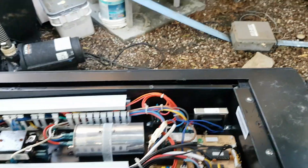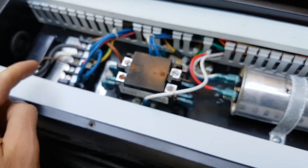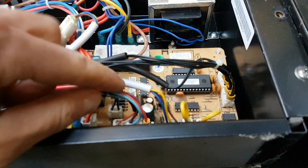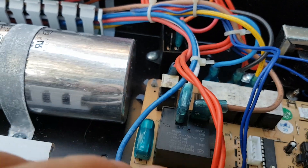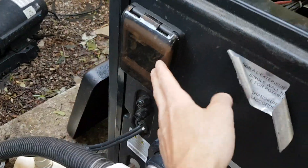We'll remove those screws and lift this cover. Now we have access to the electronics beneath and the diagram is actually right here. We can see the high voltage mains comes in here, there's a contactor, and then this is the low voltage control circuitry. Just looking at this, there's a capacitor nestled right in there that looks kind of swollen. We also have a fuse over here. The person here before me did jumper this and the unit turns on absolutely no problem. One solution suggested to the homeowner was to put a toggle switch to turn the thing on and off because this component seems to be difficult to track down.